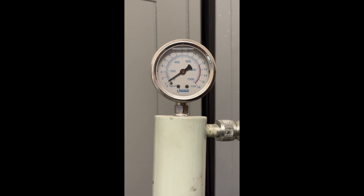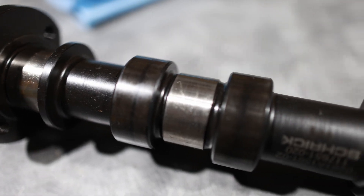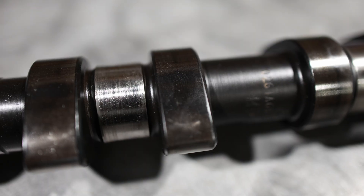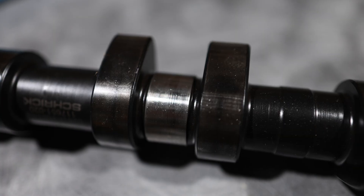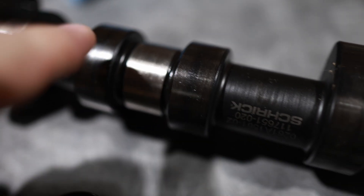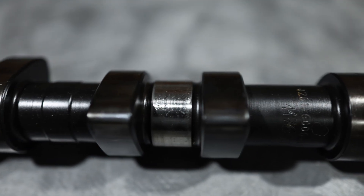A lot more pressure than OEM. I've never actually had a failure - this is the first one. So what could it be? This is the exhaust cam, and you can see more of the same oil starvation I was talking about. It definitely had some trash run through it. There was obviously a broken retainer, but that's not a lot of stuff. I think maybe it could be fuel related. I do see where the bucket was rubbing the base circle, which means there may be a lash concern. I don't mess with hydraulic stuff very often.